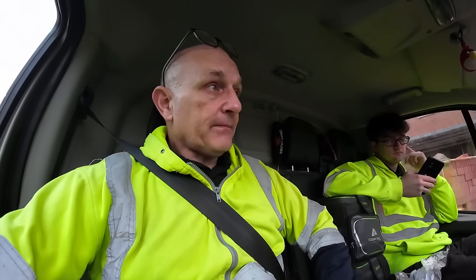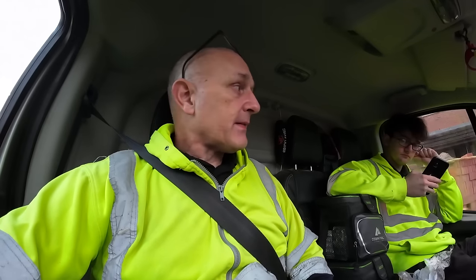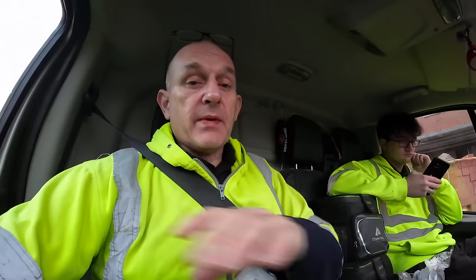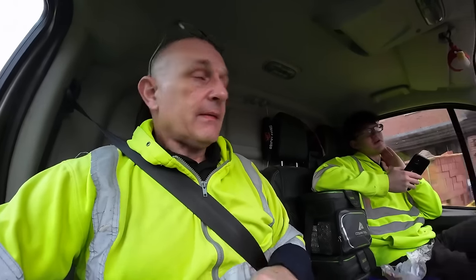And in the meantime, we can't actually do any brickwork yet because the weather's not that fit. I mean, we could, but you don't know what's going to happen. And I'm waffling again, but if we start doing the brickwork, we can't tamp across. So we're better leaving the brickwork till the slab's in.